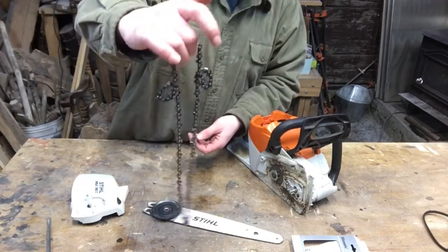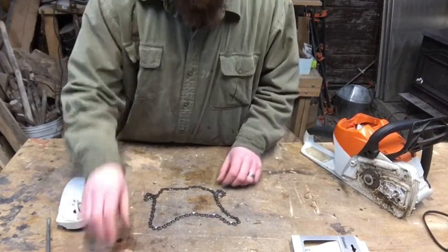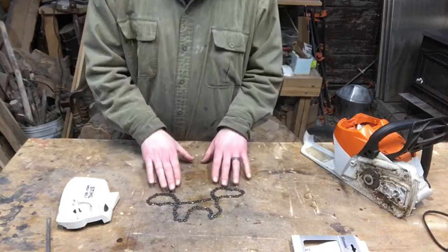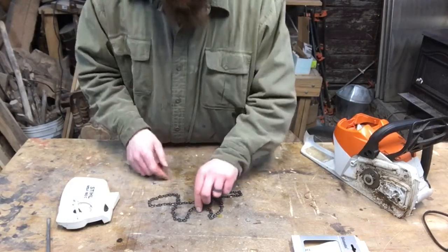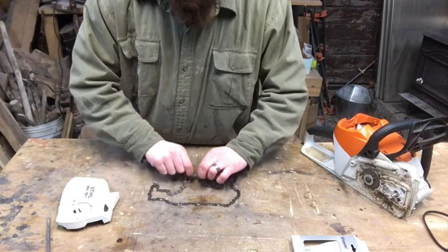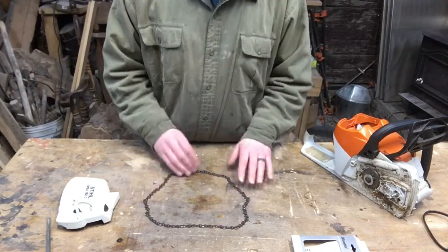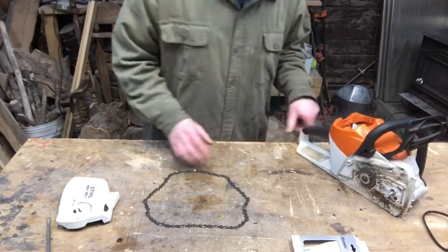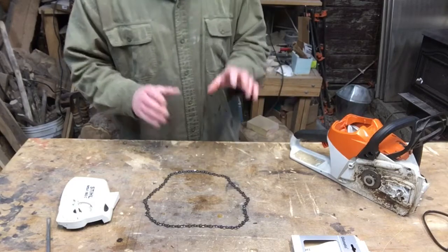Alright, now we've got something like that going on — got two knots there. When you've got this little knot in a chain, spread it out so you guys can see what I'm looking at. You put your chain out, it looks knotted, and you end up with these loops. This one goes over and this one goes over — these two go over it. So how do you fix it? Set it down, lay it down, and kind of pull the knots apart so you can look at everything. As long as they go over one another, grab this side and pull it back. When I first started messing with chainsaws, for the life of me I could not get a knot out. The little things can really deter you from doing a very simple job that you can do yourself and save yourself some money.